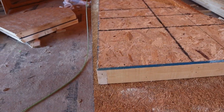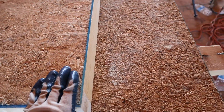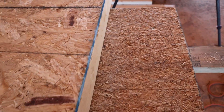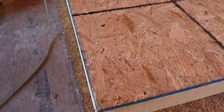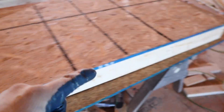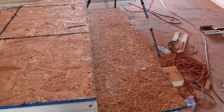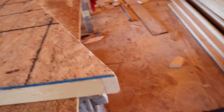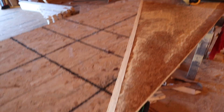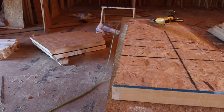There it is — nailed it off. Something to note: when you put this together, get this side lined up even first and nail that off so it's squared on this side, then come up here and line up this edge and nail it. Come down and line up this edge and nail it off. The reason you do that is it keeps the wall square — hitting your bottoms and sides first is how you keep any wall you build square.